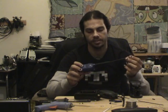Now, this one over here, this tiny little blue radio, is actually an off-brand piece of crap. I do still need to do a few little minor adjustments to it to get the connector in. I didn't hot glue it in. To cut the actual stub piece off that used to house the old antenna, I just used a coping saw and chopped it off. This is housing a standard SMA jack. Again, they're very easy to obtain. Standard amateur radio supply shops will have them.